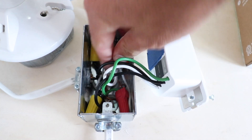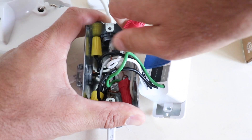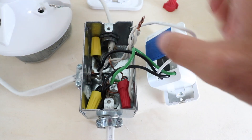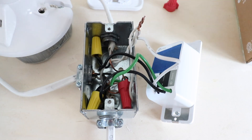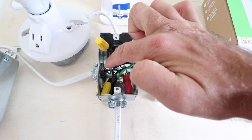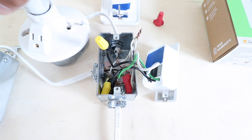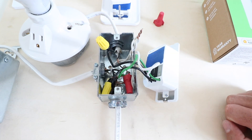Now that we've got a picture of the existing wiring, we're just going to remove the existing wires and wire nuts one by one from the existing switch. Just reach in there, pull the wires out, and twist counterclockwise to undo them. This white one is that neutral wire we were talking about. The next wire I'm going to undo is the load wire — this black wire goes up to the light fixture. It's called the load wire because that is the electrical resistance and load from the light bulb.